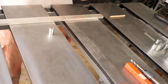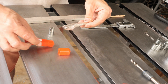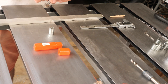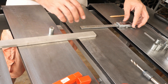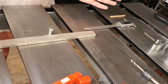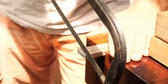Or you can simply drill the hole in the aluminum flat bar. It's 14.92mm so let's assume it's 15 millimeters. For that I will be using a 15 millimeter Forstner bit. This video will also answer the question of some of you who were wondering if they can use the Forstner bit to drill aluminum. We have to perform every step as accurately as we possibly can, so this will ensure that our jig can be trusted.